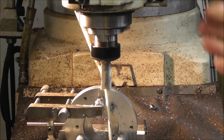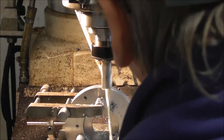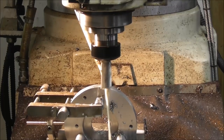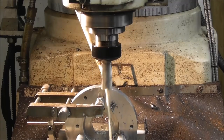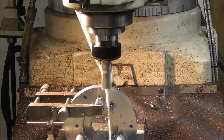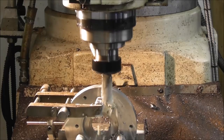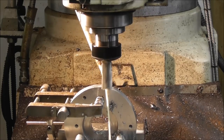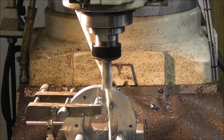And we're going to do a 45 degree angle now. So I'll just change to another tool number, zero, enter, back off 1 millimeter, and back off 1 millimeter. That's 45 degrees. Big radius scallop, back off another millimeter, 45 degrees scallops, and one more. So that gives you the ramp angle for the camlock.